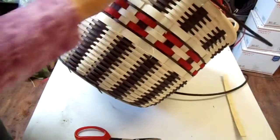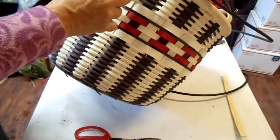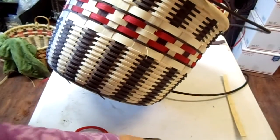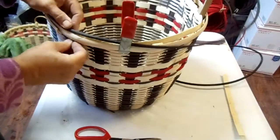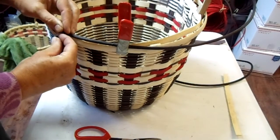You put the rim on the inside and the outside. One of the reasons why I use half-inch instead of a five-eighths rim filler is because I want that little bit of room so that this kind of tucks down in here and doesn't pop up on top so much. And when I did do these, I thinned this on the overlap for about two, two and a half inches — just so you know that I did that.